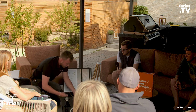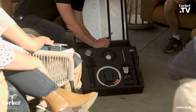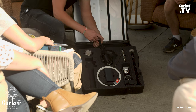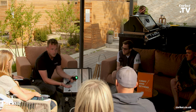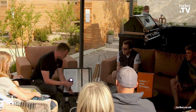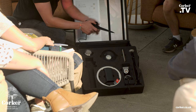I'll show you how it works. You have this great clip, put it in, turn the hood on it, and every fixture has a cable like this — you put it in and you've got a connection. That's super easy. If you have to install a light on 230 volts, it probably takes you 20 minutes per fixture. On our system it only takes about 20 seconds. So it's super simple, and in this way every landscaping company can do their own lighting without needing an electrician.